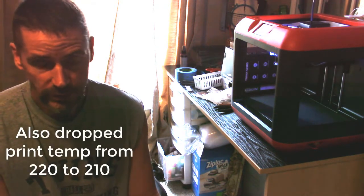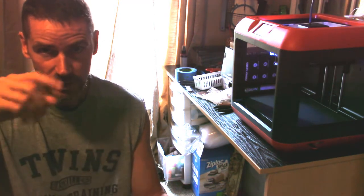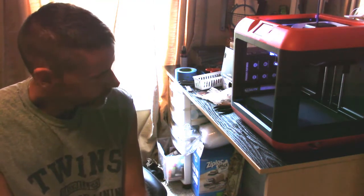The other thing we did was put a brim on almost everything I print. It gives the extruder a chance to totally clear as it does a border around your print first. I would say 90% of what I print I also do on a raft, again to help with dealing with any leftover filament from oozing and also to provide better adhesion while printing.